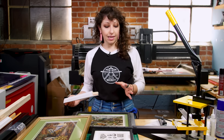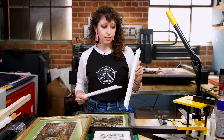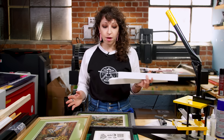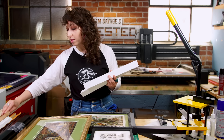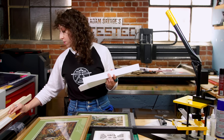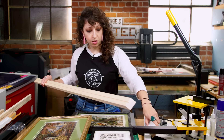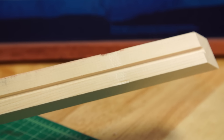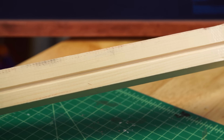There are a lot of different ways to get into this. I've got fancy molding — typically pre-finished wood, sometimes resin, with really nice decorative frame profiles. But you can also do this in much simpler ways. I went to the hardware store and got some simple one-by-twos. This is some red oak, and I've also got plain pine. What I did was route out a channel using the table saw to cut a channel for the artwork.